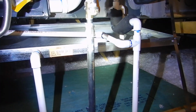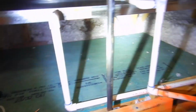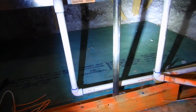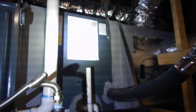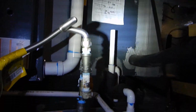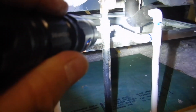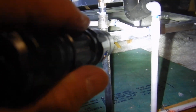So is that going to hurt your sewer system? Is it approved for this municipality? The code inspector is the one person who can tell us about that. I'm saying there's lots of good reasons to have a neutralizing filter. I'm not seeing a neutralizing filter. So let's go to the evaporator coil. We got these coils right over here, and we got a shallow P-trap going to commingled with our noxious gas condensate and going down into the sewer.